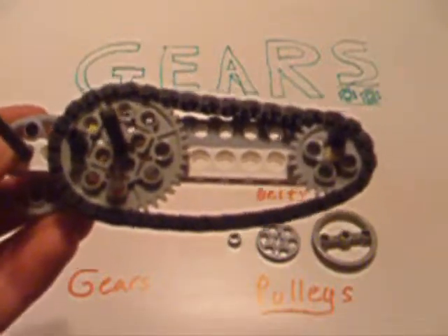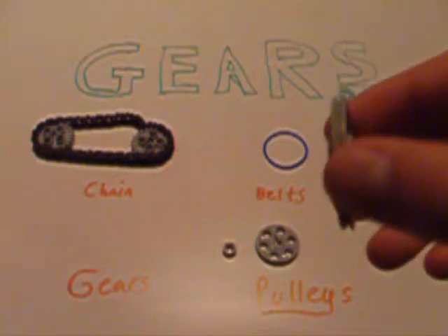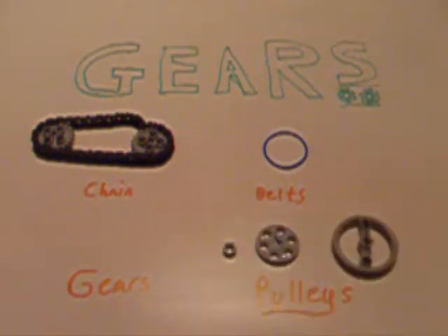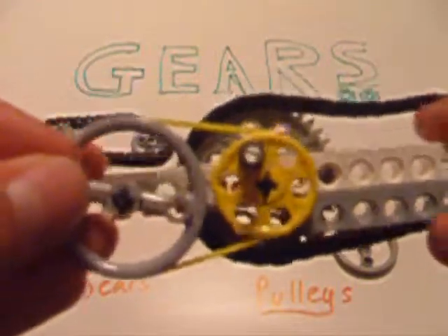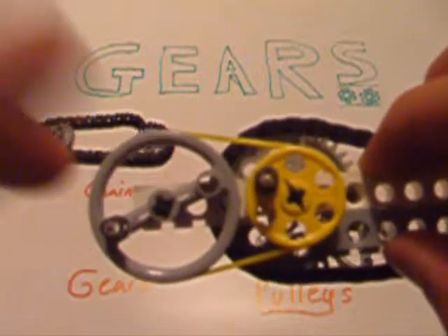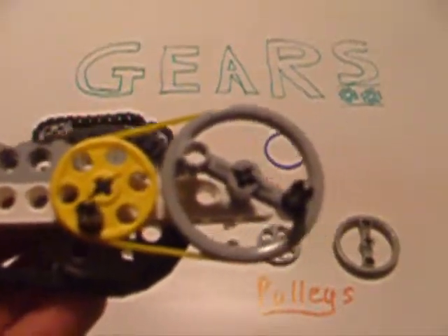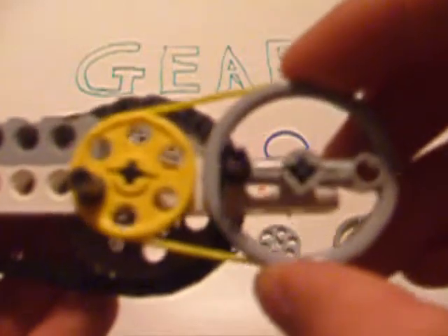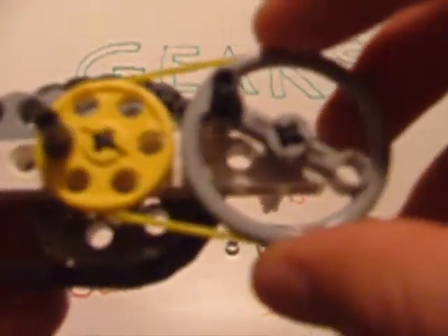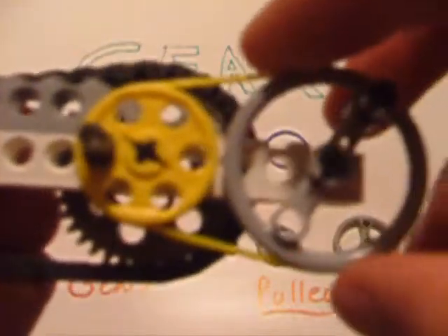Once again, there are numerous uses for this. Belt design requires pulleys instead of gears. Honestly, a pulley can be anything with a groove in it — I have three examples here, including half bushings that we looked at in a previous episode. You simply loop the belt around the grooves in the pulleys and rotate them. Another way to transform motion. The only thing you have to consider while working with pulleys is that they don't accept a lot of torque or a lot of speed. If it starts spinning too fast, the pulley will start to slide in the groove and won't have a good grip. It's especially bad if you want to use something with a lot of torque, because after a little bit of pulling it simply will not rotate the other pulley.